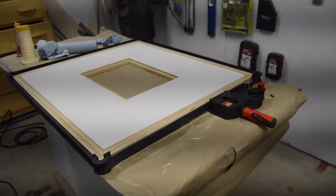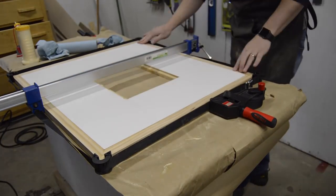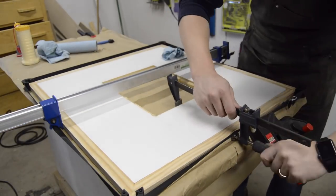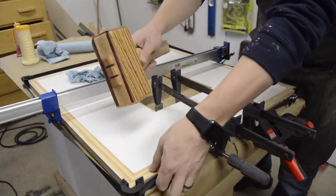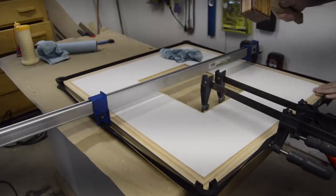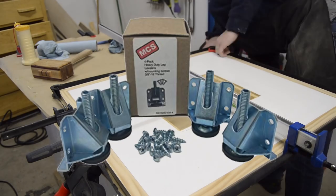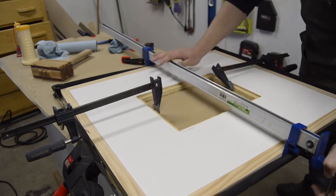If you remember from the last video in this series, at some point in this build I dropped my camera on the concrete and couldn't film for a few days. It was during this downtime that I actually attached the melamine top to the cabinet, using just four upward screws from within the cabinet. The idea is that if I ever get a new router base plate, I can easily remove this melamine top and make a new one. One thing I forgot to mention in the earlier videos is that I attached some leveling feet to the four corners of the cabinet bottom. I'll include a link to those in the description as well.